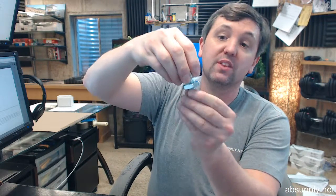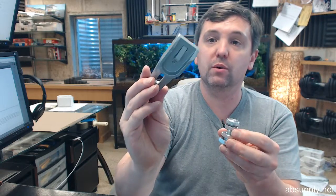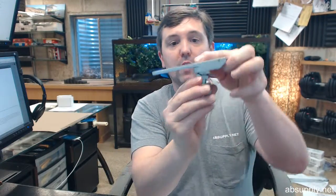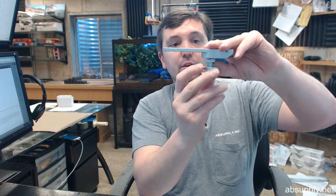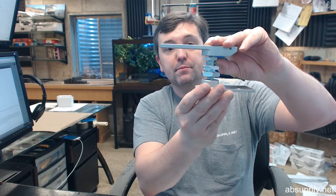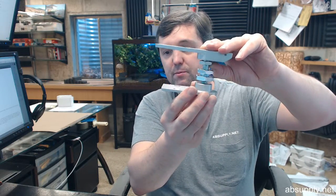You can drill a hole in the threshold itself, bolt this unit to the threshold, install the threshold, then the door will actually rest on this spindle with the bottom arm. So what I'm saying is it's either this to the threshold or this without these bolts for the threshold down to the floor plate. That's how that'll install. That's your dual purpose. Mounts directly to the floor or to the threshold.